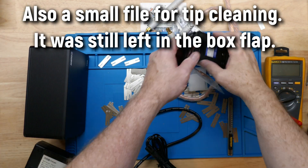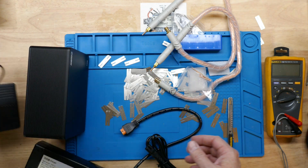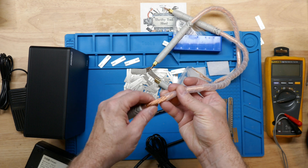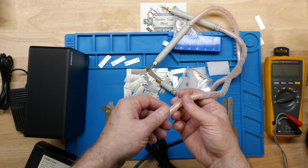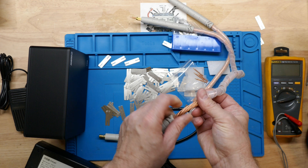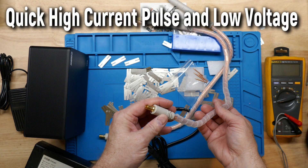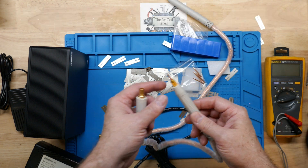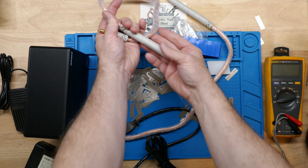It's nice that it did come with a little foot pedal, but it is very, very light and very cheaply made — but it may work just fine. These leads are very impressive. This is very flexible, fine copper. The insulation stops here and we just have the spiral wrap over it. That's really not a bad idea to keep it very flexible. I thought it would have a clear coating over it, but being a spot welder with momentary output, that's probably still very safe. It's hard to describe just how beefy and solid these leads are — nothing like anything on a spot welder I've seen before.